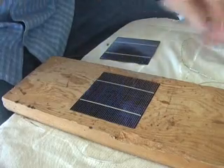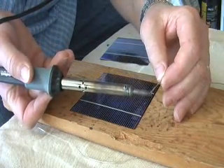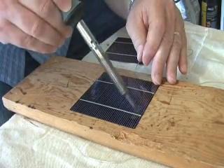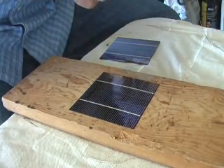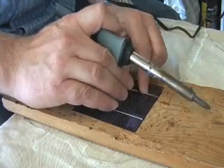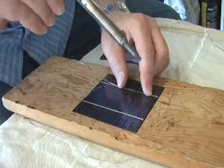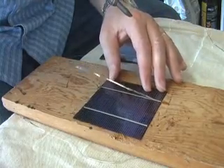One trick I've found: start out by taking a little bit of solder and just touch it to the tip of your soldering gun. That way you know your soldering gun's hot enough — a little bit of melt. Now just touch a small dab right on the end where the solar cell tabs are, the tabs you're going to solder to. Then take your first piece of cut tabbing wire, lay it down right along that strip. Don't go over the end. Now, that flat part that we filed — make sure that's flat with the solar cell, then just touch it right like that. That little dab of solder will hold it on there, so now you can work with it.